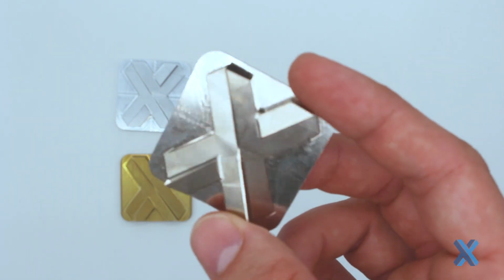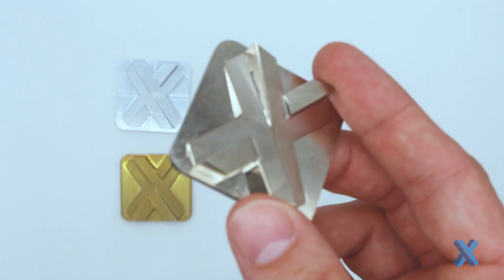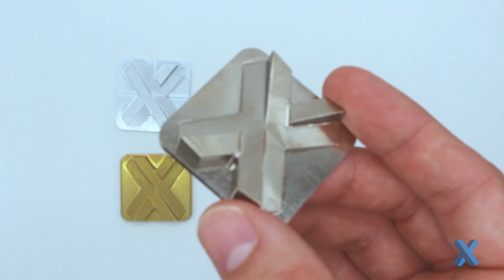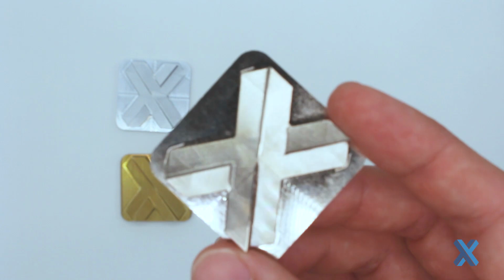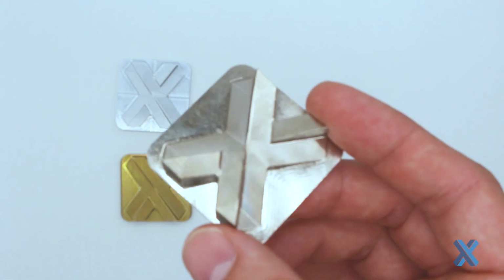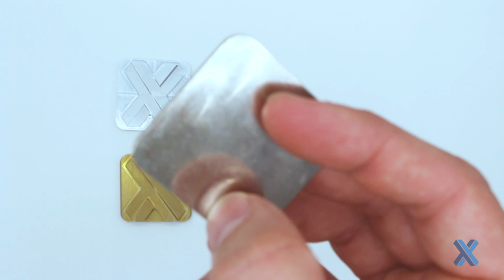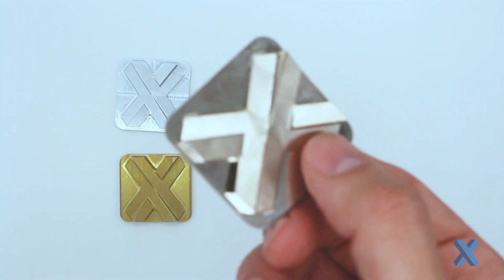But what's nice about this is it only requires a conductive surface, so I can use nickel plating for something like a steel alloy where I can't actually do a film conversion. So when I look at this, I'm looking for highly ruggedized applications or applications where the outer surface will enhance or augment the capabilities of that base material. Metal plating is also just very good to keep a protective layer and really maintain that part over its lifetime.